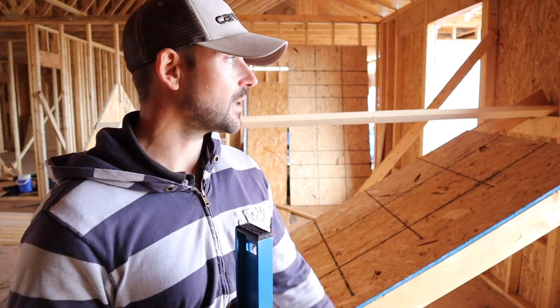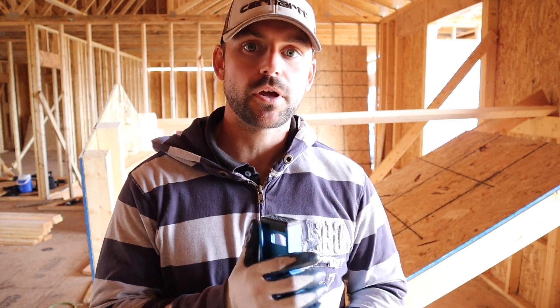The first thing we're going to do is plumb up this face behind us on the mock roof we built, and then after we plumb that up we can start building our sidewalls. I tacked a board to the back wall to give me a place to tack the face after I get it plumbed up, to hold it secure while I'm working on these sidewalls.